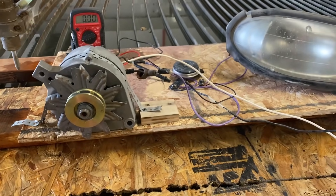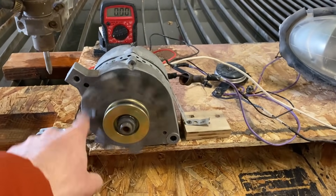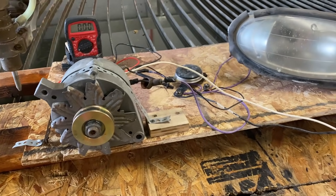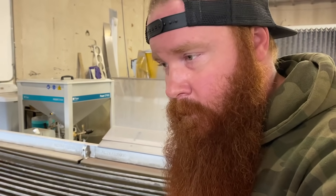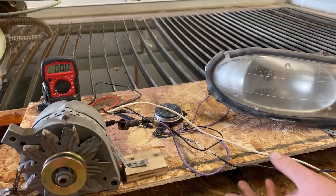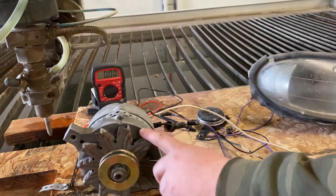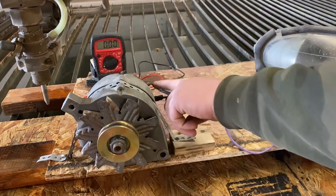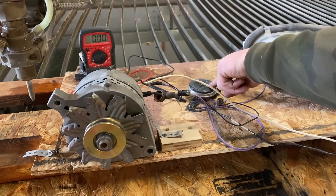So in that clip, the noise that this was making when it was running was a lot lower, which means it was running under a lot more load than when we weren't producing any voltage. And it was operating everything really well. We capped it at like 9 volts. The important thing is that the alternator was powering itself — it was generating enough power to run its own magnetic field and keep working, running the horn.